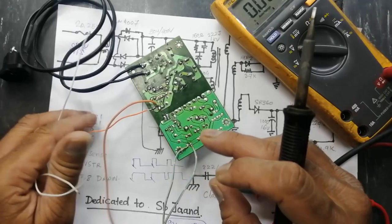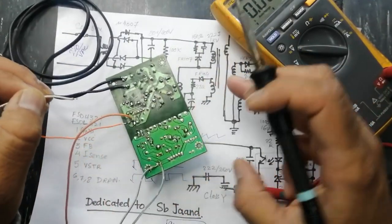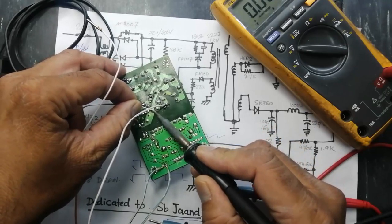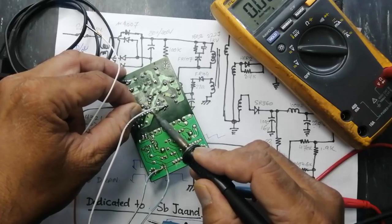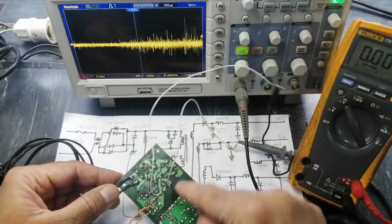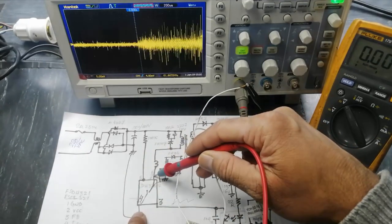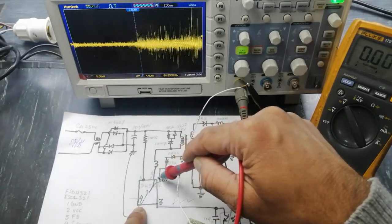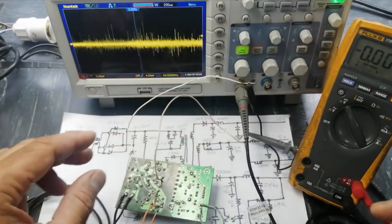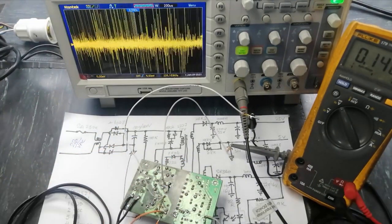I connected a pair of wires in the output section to monitor voltage and connect load, and to monitor VCC voltage. As discussed, when load increases the VCC voltage will increase and the IC will increase switching. Now I will connect the oscilloscope across the IC switch — at the drive stage of the transformer primary winding — with this end as ground, to monitor how long the internal switch turns on and off. VCC is currently at 12 volts.